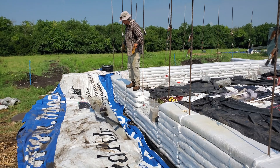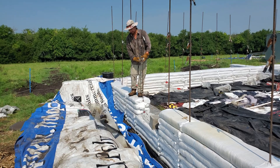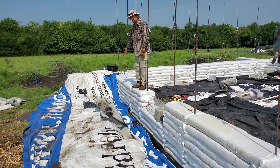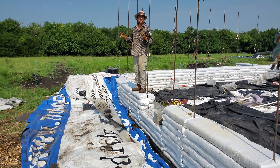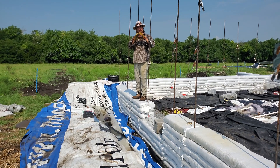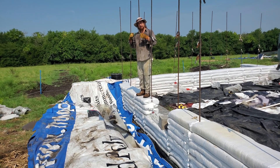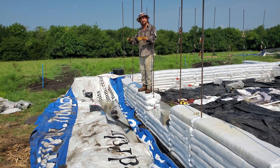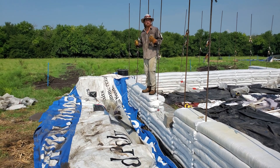You can see here we're pulling off this tarp. I'm using these clamps to clamp the tarp, and I've already unclamped most of them. It rained this morning and it gathered all this water here. Underneath this is basically a French drain — some call it a wicking drain — but it's a four-inch perforated corrugated plastic pipe that got laid down on the bottom. Some gravel was put in, the pipe was placed, and all of that was wrapped in landscape fabric.